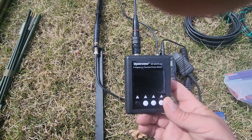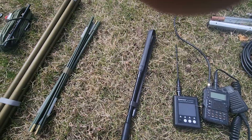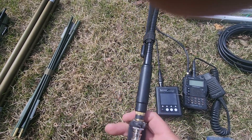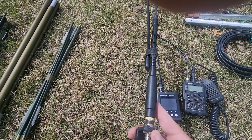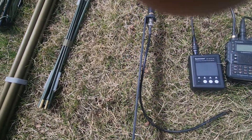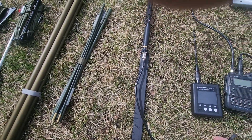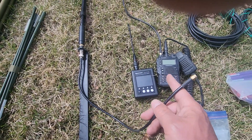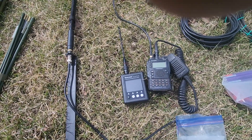This is a folding high-gain gooseneck antenna. It's far too heavy to just put on the radio — it outweighs the radio by about three times. So what I did was get an aluminum flat strap, bend a 45-degree angle in it, cut it at a proper length to tune the antenna, and put a lead as a breakout to take all the weight and stress off the radio as well as increase its performance potential. It is a reasonably significant increase.